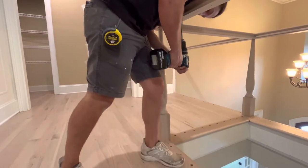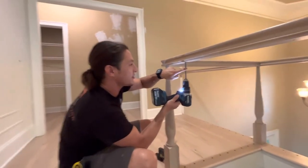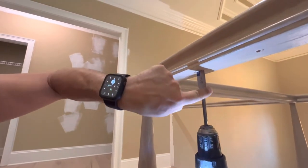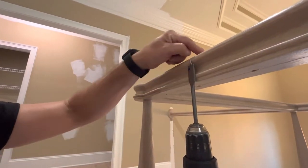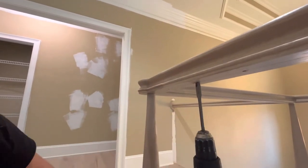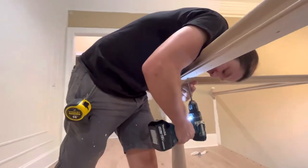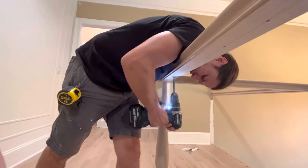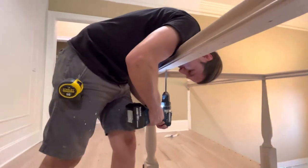I'm going to lean over the handrail, get it started. What I'm looking at is this shoulder of the spade bit. We typically want about an inch and a half inside the handrail. If I step my bit out here, the top of my bit will not go through the handrail — and that's a good dimension and a good depth for the top. So once I get that drill bit inside my hole location, I lean over the edge and my eyes are on that shoulder. I stop, remove, go to the next one.